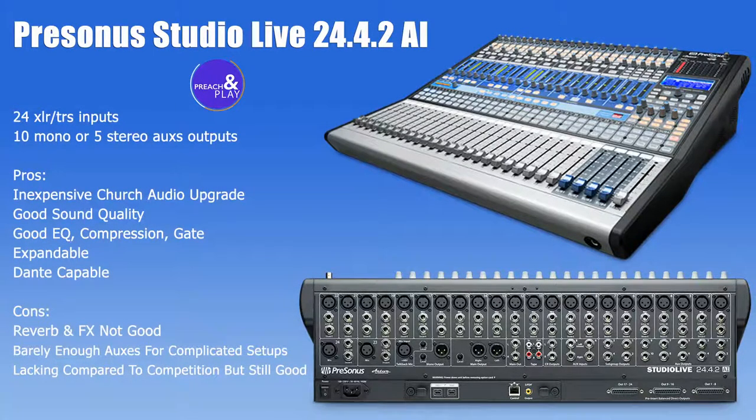It's expandable. If you fell in love with it, you can connect two of these consoles together. You can also expand it using Dante — I've been educating everybody about Dante. I use Dante on my job and it is absolutely awesome. Dante is an IP-based audio protocol that can go up to 100 meters with a Cat 5e cable — that's like 300 feet, which is amazing. The sound quality with Dante is great and actually cleaner because everything stays in the digital domain. I have Pro Tools HD — two racks behind me — and I don't even use them anymore. I'm straight-up Dante now.